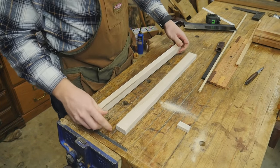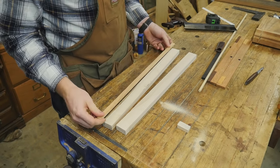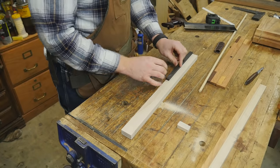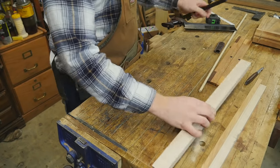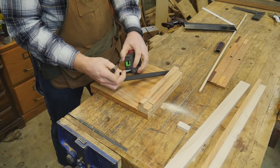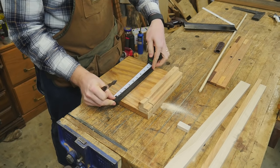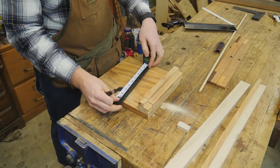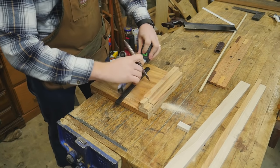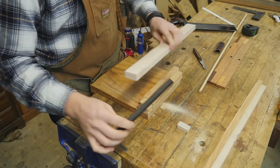Let's choose these out — this one's got a dark spot I'd like to remove, so let's make that one the light side. I'm going to make a rabbet that goes all the way across with that one. With this one, I'm going to cut it in half and put a little piece of ebony on both sides. So let's cut that in half — it's about nine inches long, so four and a half. I don't really care about this being too long because I'm going to have it stick out past the end and just trim it off flush with the actual end of the piece it's going into.